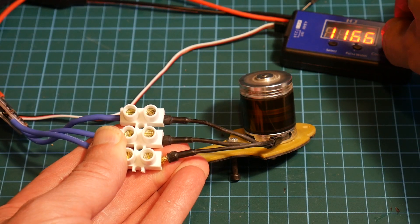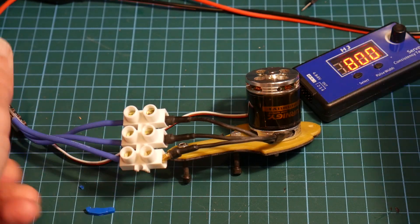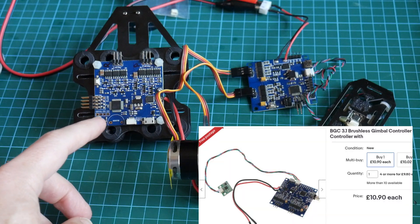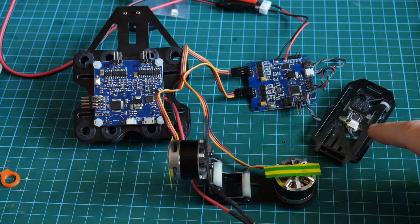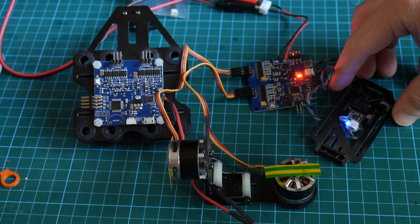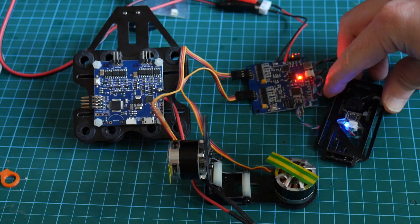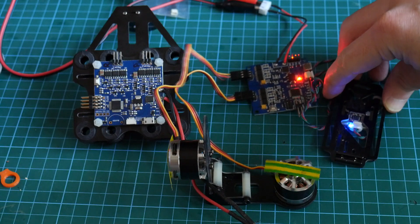I had no problems with the three high speed motors either. I've got this gimbal controller that came with it — I managed to burn it out, but fortunately I've got a second one. It's a BGC, and they come with an MPU-6050, so they're perfect for gimbals. They cost about £12 but I don't really like them. I'll talk a bit about the Storm32. So I wrote some code that basically reads the pitch and roll of the MPU-6050 and tries to move the motors. You can see the motor on the left, one of the non-brand motors, is having problems.